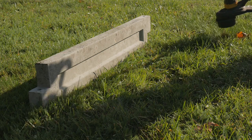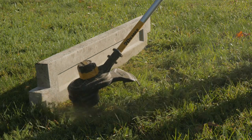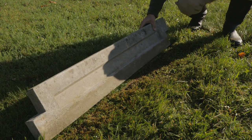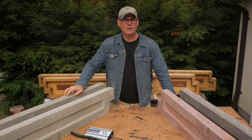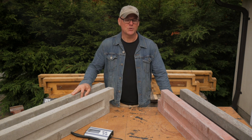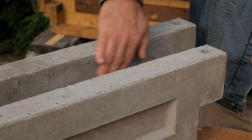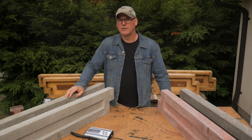Then I could test them for durability. As in Part 3 of this series, I lined up panels on the lawn and ran an edge trimmer against them. The line trimmer didn't damage the perlite concrete at all. Like the vermiculite, the perlite-based concrete mixed easily and was noticeably lighter, which made it easy to fill the forms. It settled well with vibration and has a smooth texture while troweling and edging. It came out of the forms easily and has a nice smooth finish. It passed the weed eater test, so I think perlite concrete in these proportions makes a good lightweight alternative for these garden panels.